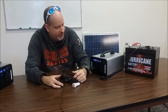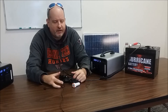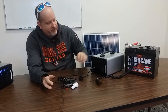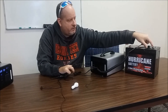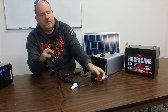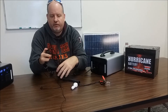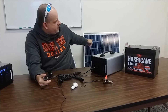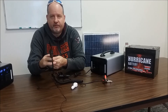I think I need to make that disclosure. Any technical questions you have before purchasing one of these units, feel free to email me at Tony at hurricanewindpower.com — I'll put the link in the description below. Once you get the plugs sorted out, you wouldn't use an adapter with light gauge wire like 18 gauge. What you can do is put two MC4 connectors on here and attach 100 or 200 watts of solar panel, because this DC-to-DC plug is rated for 12 amps.